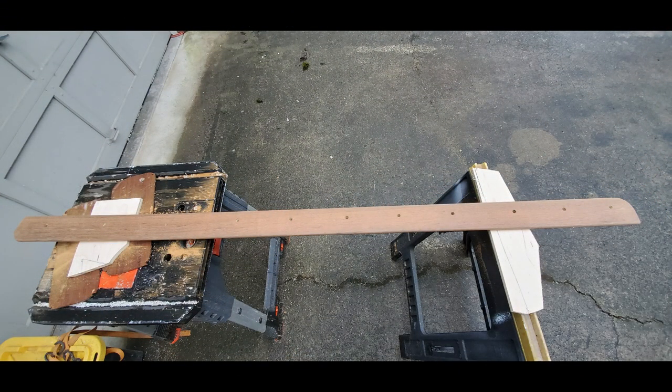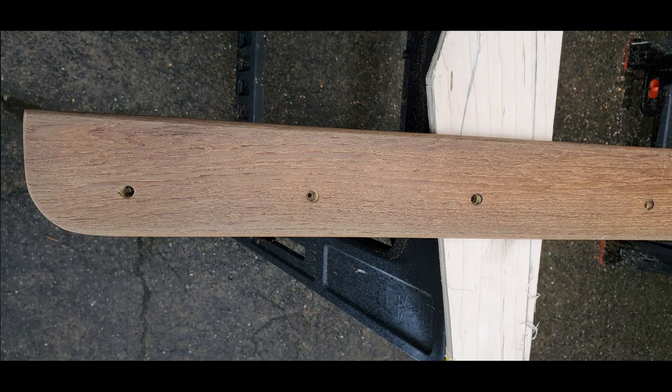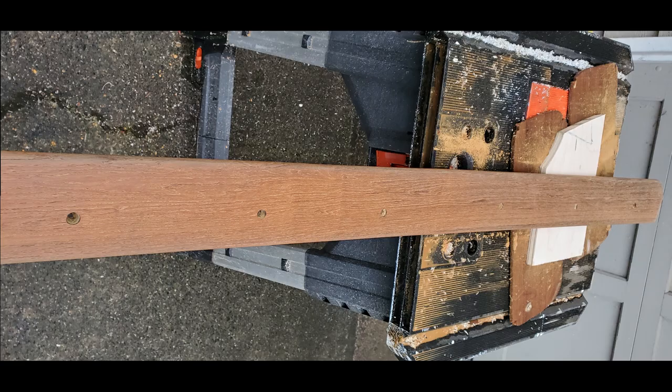These are the long pieces of trim from the aft cabin. We took these home and stripped them down to prepare them to refinish. We want to put on the new matching varnish we're using on the rest of the panels, so everything has the same tone and color. We sanded them with light sandpaper to remove just the very top surface of varnish, so we don't have any discoloration or old varnish left on the wood or in the pores. Then we clean it and wipe it down with acetone and a dry tack cloth to make sure no dust is left, so when we apply the new varnish, nothing's going to show.